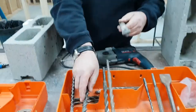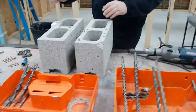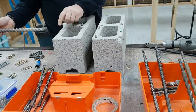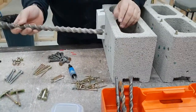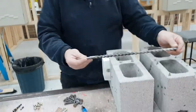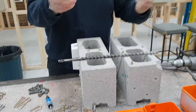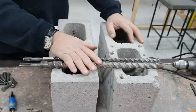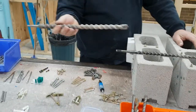This one is like a 20mm bit. If you imagine a double brick wall, this would be used to go all the way through and then you could poke a 20mm conduit through. The only problem when drilling into hollow brick is that these create a lot of vibration and can actually cause the brick to shatter, so be very careful. Sometimes the easiest approach is to use a small drill bit as a pilot drill first — once the pilot hole is in, it's much easier to open it up with the bigger bit. These long drill bits are also used for drilling through concrete slabs, such as for an earth stake.